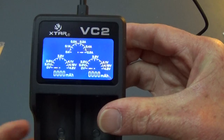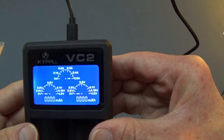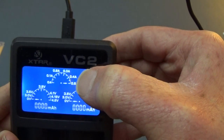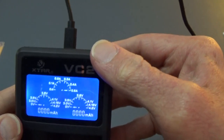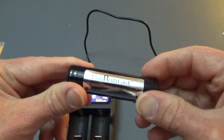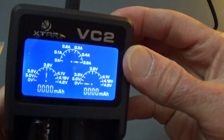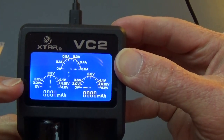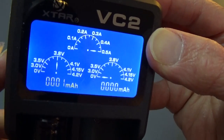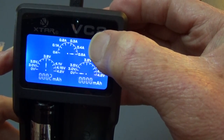This is the VC2 charger and this is the display I was talking about — it's very visual. At the top you have the amount of mA the battery will receive. Right now the dial is saying 0.5. I'll put a battery in to make this make more sense — we have an 18650 here. Right away on the left-hand side this is telling me the battery has 3.8 volts. The dial went to 3.8 upon insertion of the battery. Over here, the dial is telling me it's going to charge at 0.5 amps.